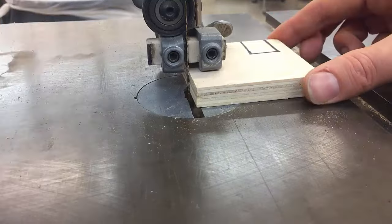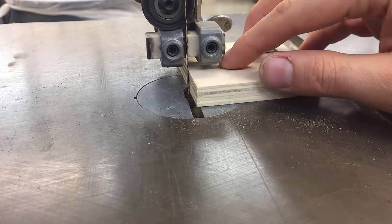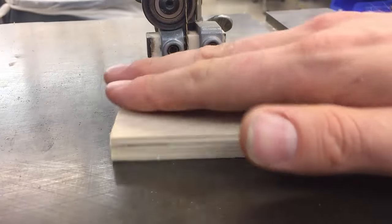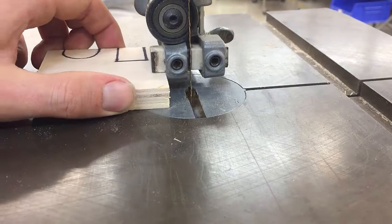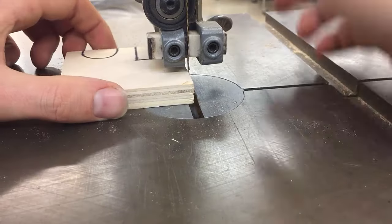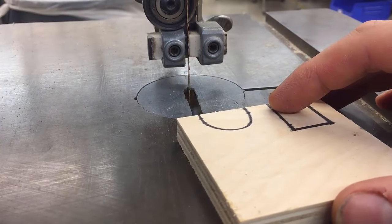Put the wood in, drop it, tilt it, and tighten it. And now that's a teeny tiny gap — it's like a sixteenth of an inch. The wood moves freely. My fingers can't get in there. Nice, smooth movement. I'm ready to cut. So that is how I quickly set the guide height.